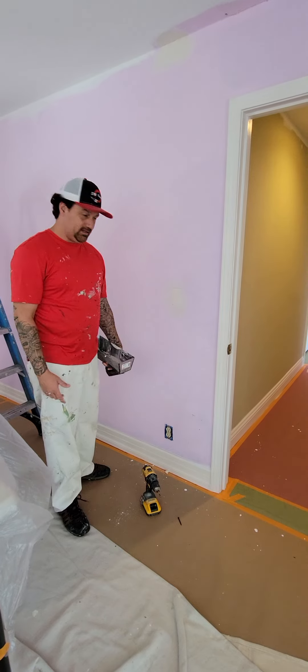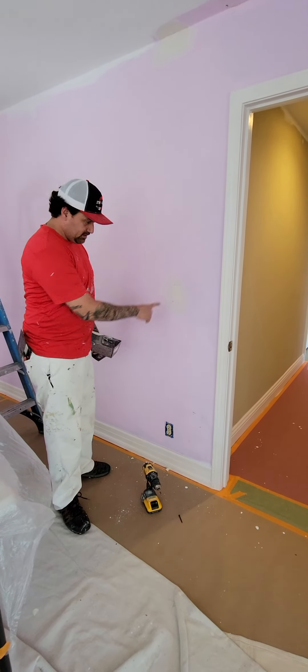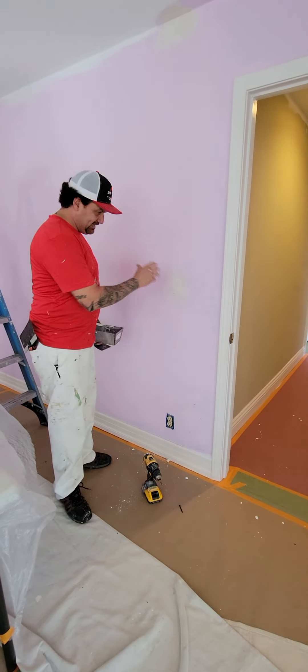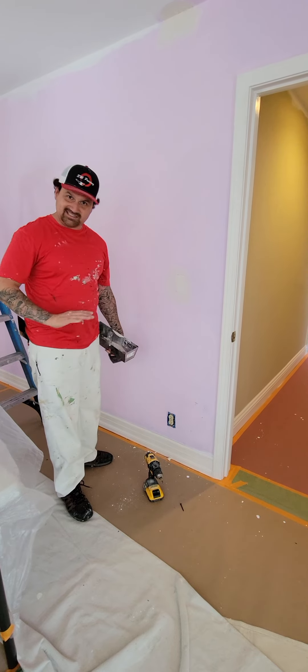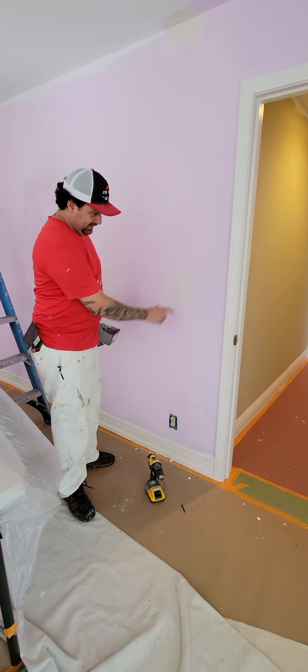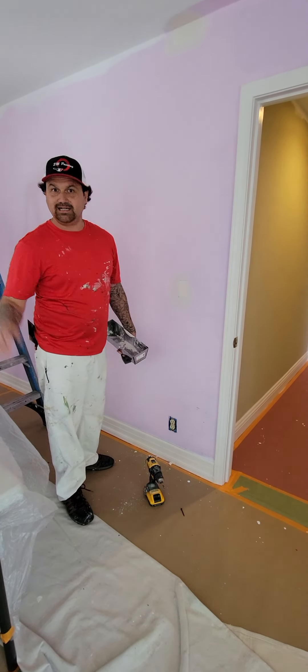It's not worth spending all that money on a sheet of drywall just for that spot. So I'll put some back in there, throw that little bit of hot mud in there, let that get hot — it'll harden up just the same as drywall. I'll come back with a top coat, some joint compound and some mesh tape, mesh the corners, throw it over there, wash it out — it's done.